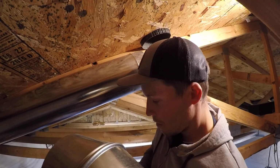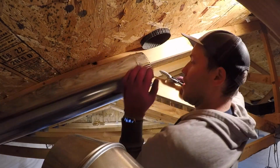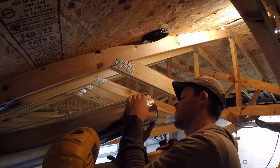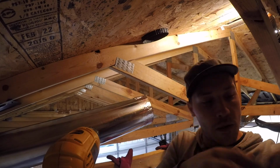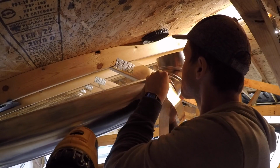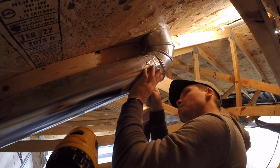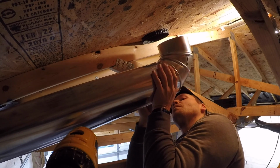Back inside the garage, I could now connect my ductwork to my newly installed vent. The 5-foot length of ducting was a tad long when used with my angled connector, so I trimmed a bit off using sheet metal shears. Though I accidentally screwed up and trimmed a bit too much off on the opposite side of my cut, so you see my hack job attempting to repair it before actually attaching it to my elbow connector. That's why there's already foil tape where there wouldn't normally be. Thankfully, attaching the elbow connector requires that same foil tape, so my mistake was mostly covered up by my intentional tape.